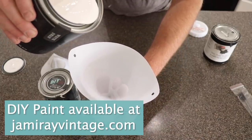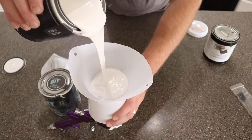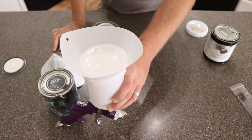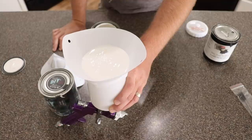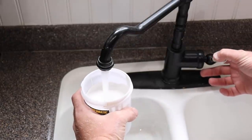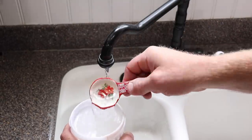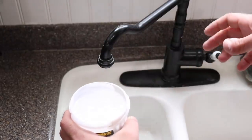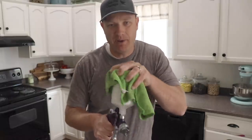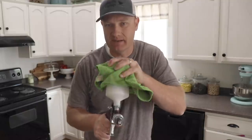Time to get paint in the hopper. I've got my strainer and I'm dropping the DIY White Swan paint right in and letting it strain through. Going until I have 15 ounces in the hopper — the DIY paint is thick so it takes a little longer to strain, but it will go down. I've got 15 ounces of DIY clay-based paint, now adding five ounces of water, plus an extra couple of tablespoons since it's thicker. I'll use a rag over the breathe valve while shaking. The DIY paint is all natural, but make sure you're wearing a respirator — you don't want paint in your lungs.